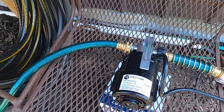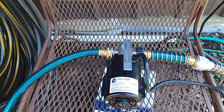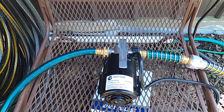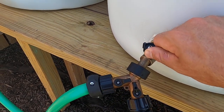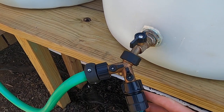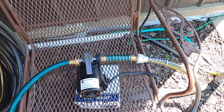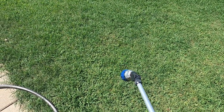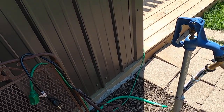One important thing before using this pump: make sure it has liquid in it. If you turn it on with just air it can cavitate — rattling around — and damage the impellers. If it ever sounds funny, there might be an air bubble; turn off the pump and check it. First, make sure your valves are open. Our configuration right now has number one closed, but we can draw from the other two. Let's open them all up — we've got flow, the pump is primed, and we're ready to go.